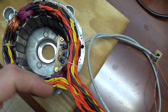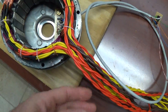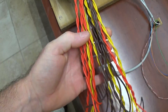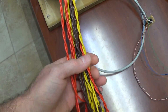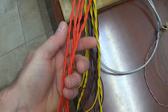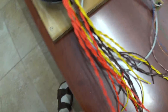Most likely this motor is going to be revving at a higher RPM than was originally designed for, and that's fine. I have access to all of the coils here, all coming out separately so I can do different tests. What I'm going to do is combine them: all the red leads will be the pink coils, all the yellow leads will be the copper coils, and the brown leads will be the black coils.